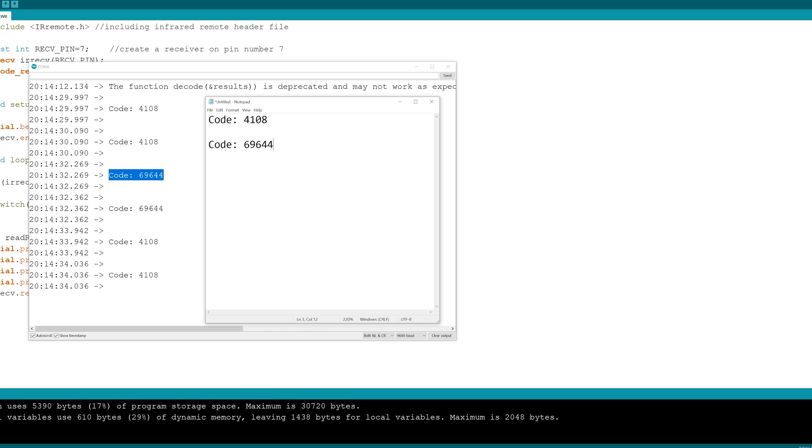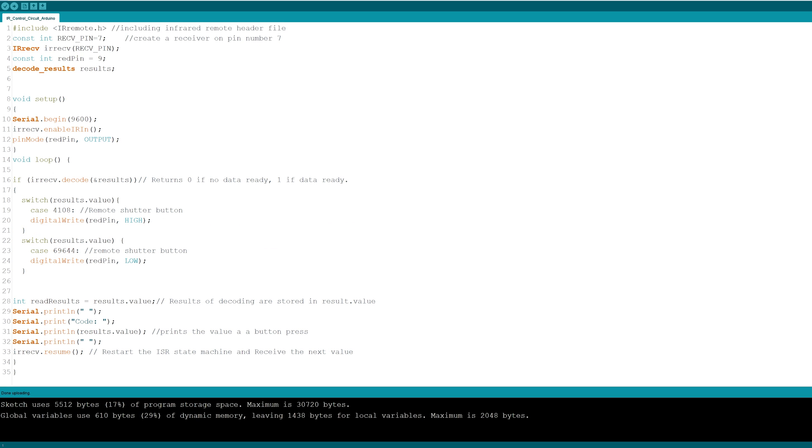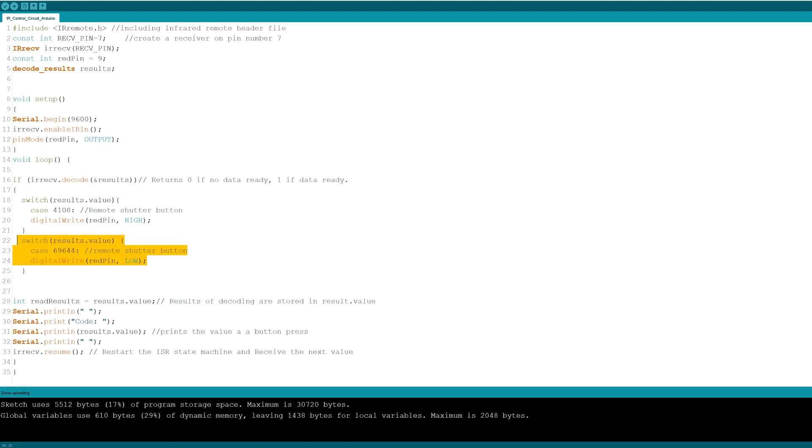Now it's time to move on to step 2: turning on the circuit. The Arduino needs a different program loaded using the same IR remote library — a link to download the code will be in the description. Once uploaded, the Arduino Nano will not only receive the infrared code but act on it. It will output voltage on pin 9 when the code is received, sending voltage to the relay driver circuit which switches on the relay and sends 5 volts to the Pico to power it on. A second code will remove voltage at pin 9, turning the circuit off — the same theory as how your TV or sound system remote works.